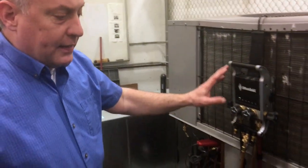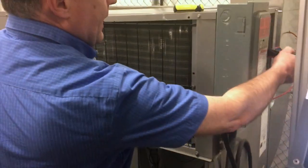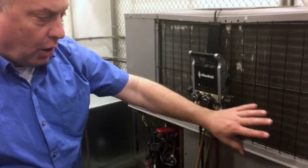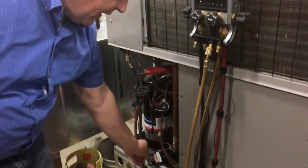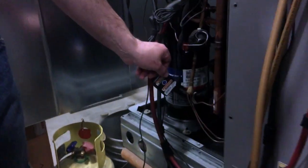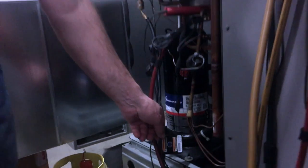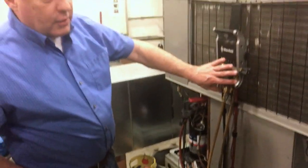I'm going to go ahead and start the system up. Two things are starting: the condenser fan and the blower. You can see right here that I have my compressor disconnected so we're not running the actual refrigeration system. We're going to let this thing run for just a minute. We're pulling air across our outdoor sensors and across our coil, and then what we're doing is letting ambient air run over everything so we can get it down to temperature and then we can start to verify calibration.